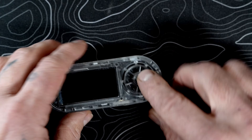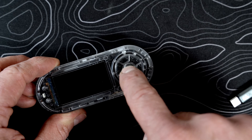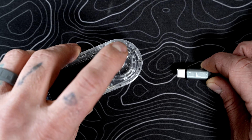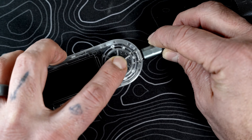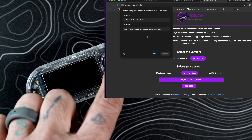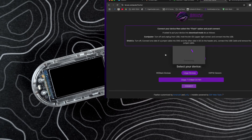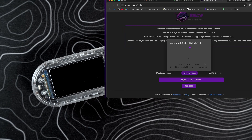We will be using the boot button, which is right in the center of your encoder dial. To get connected, hold down that boot button, plug in your USB-C, and on your desktop you should see 'USB JTAG/Serial' — click on that, then click Connect. You can see it connecting, and then we're going to install 'ESP32-S3 Dev Kit - 1'. Click Install, and if we did everything right it should say 'Erasing'. In about 30 seconds to one minute, you will have the beta version of Bruce installed on your T-Embed CC1101.